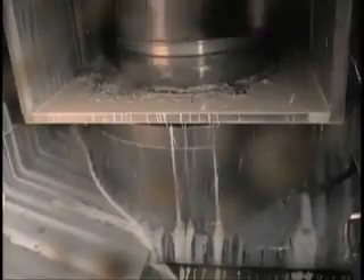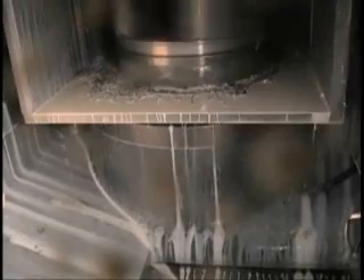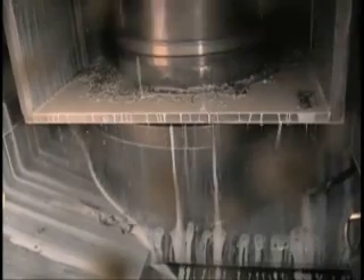The superimposed graphic shows what is seen on the control monitor, allowing the operator to view what is taking place in the machine and monitor cutting effectiveness and potential alarms without interrupting the machine. One of the greatest benefits of this operation is the chip removal system. Utilizing a high-pressure coolant system and a proprietary chip evacuating chuck, the metal chips are broken up and moved away from the cutting tool, extending the life of the cutting tool and decreasing the need for operator intervention in chip removal.